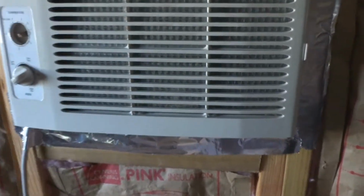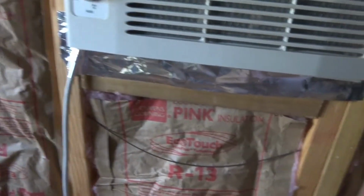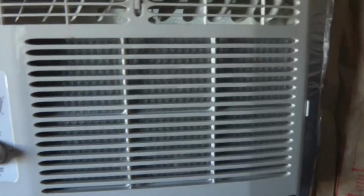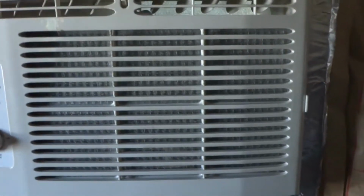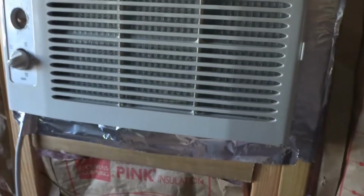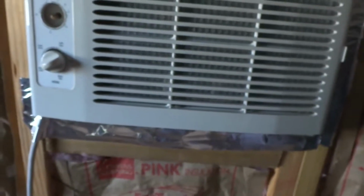Anyways, I hope y'all enjoyed this video. And actually, what time is it? 6 o'clock. I usually shut this thing down at 7 o'clock every night. I usually turn it on about 10 o'clock and shut it off about 7 o'clock. The filter's already getting dry. You can hear the fan outside slinging the water onto the coil. It's got a slinger ring on it.